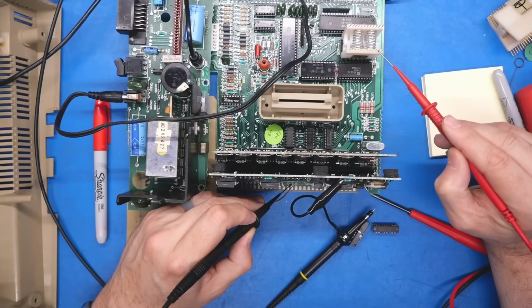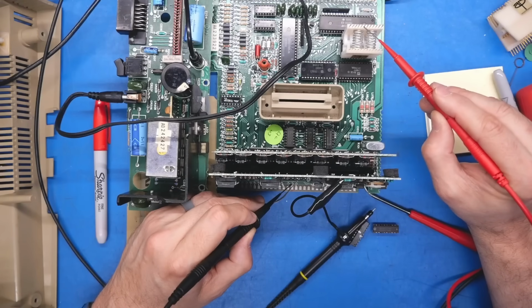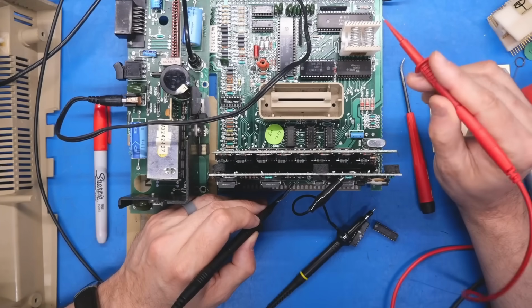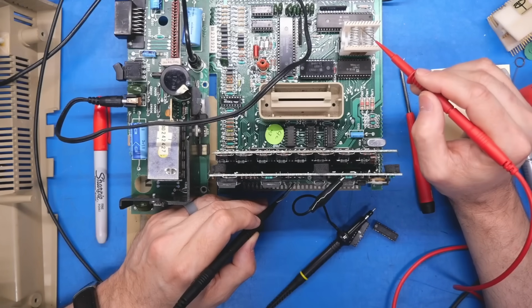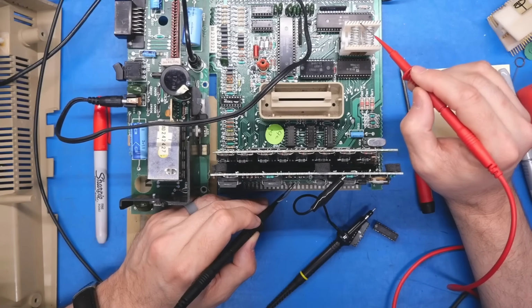And it has to be going to the ROMs. It just has to be. Oh, it's over on this side. Oh, I realize what's happening. Pin 1 is right there. I thought these chips were installed the opposite way. Okay, so that's the address line that's problematic, which should be address line 1.